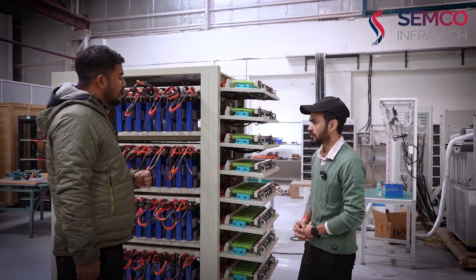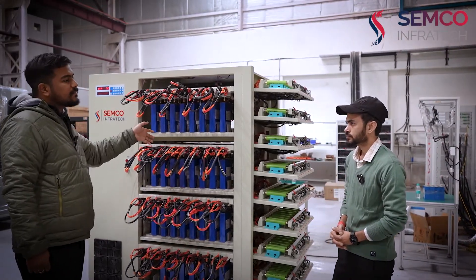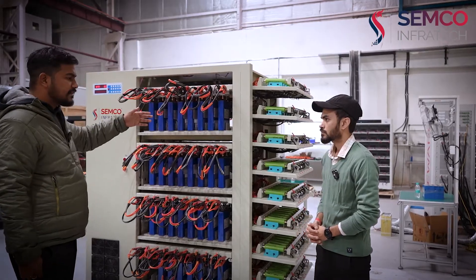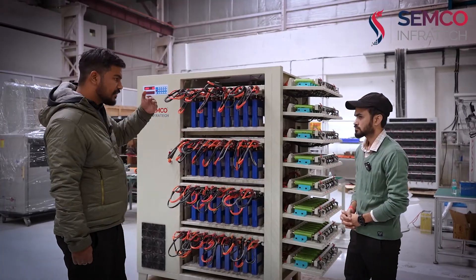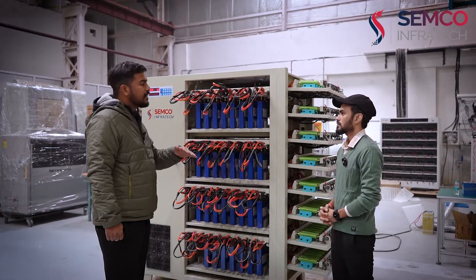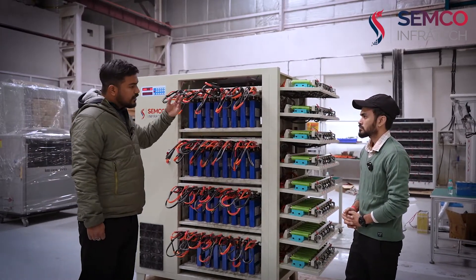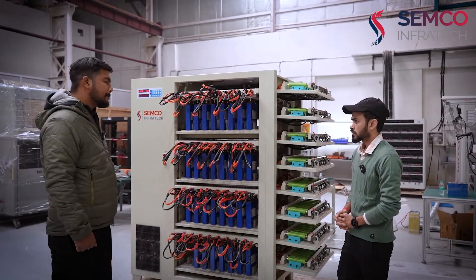The steps are: first, we have to charge. As with the previous machine, this machine is a cell grading machine. The first step is charging — we charge the cell to its highest rated voltage. The second step is rest mode. The third step is discharging the cell to its low rated voltage. The fourth step is rest again. The fifth step is charging the cell again up to its nominal voltage.